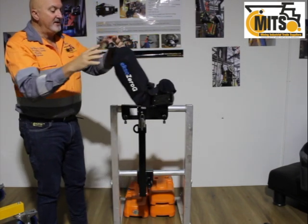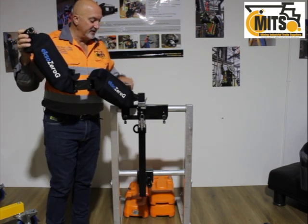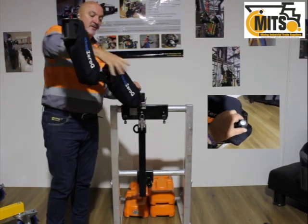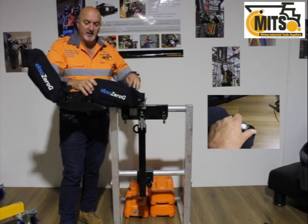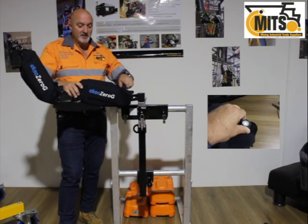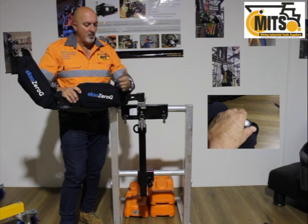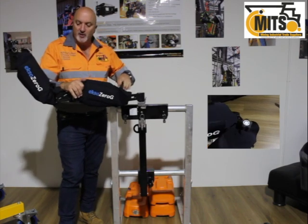Before we fit any tool, what we have to do is preload the system, so putting a little bit of tension on the arm. If you push down, you'll find a sweet spot. So as I'm doing here, really loose, too high, a bit hard to turn, too low, hard again. So just wind some in. It's very easy to do. Just what you want to do is preload it.